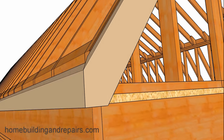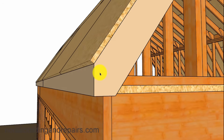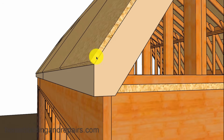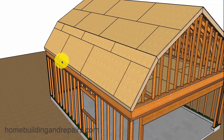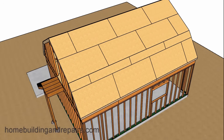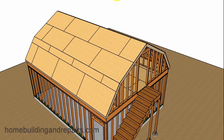You could always change the corner detail. Here you can see where the fascia board is sticking past a little bit so we can slide our siding underneath into this slotted area along with our building paper. Next up, let's go ahead and install our roof sheathing. You might need to bring the sheathing back a little bit depending on how you're going to finish this area, and you might be able to finish it with some roofing edge metal that would go all the way around the perimeter. We are using 4x8 sheets of either plywood or OSB.